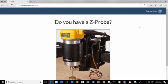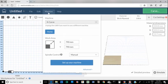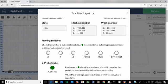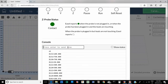And there you have it. You can get back to the machine and home it using that button, or go down to the Advanced Machine Inspector. You'll notice you're not at zero-zero-zero — that's because GRBL works in negative space. Someone tried to explain it to me and I'm not sure I fully got it, but it doesn't really matter. Your work position — what you use when you set your bit on what you're going to carve — will work in positive space. You can also use the command '$H' in the console to home your machine.